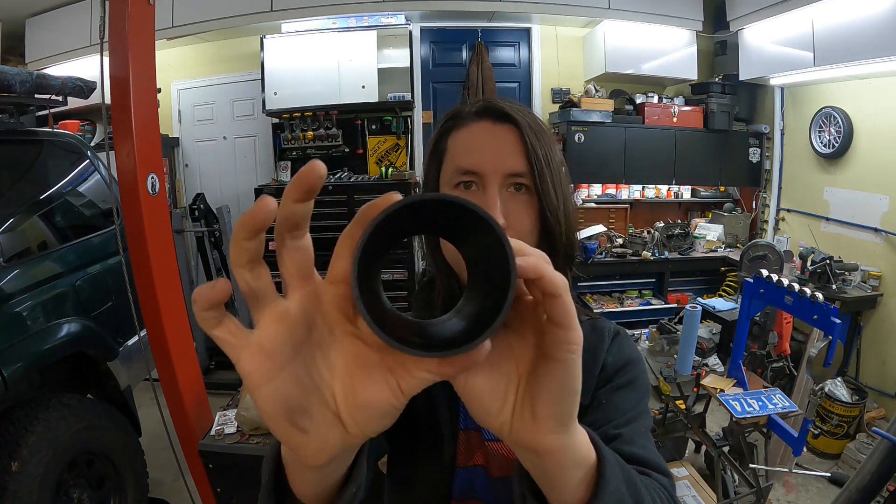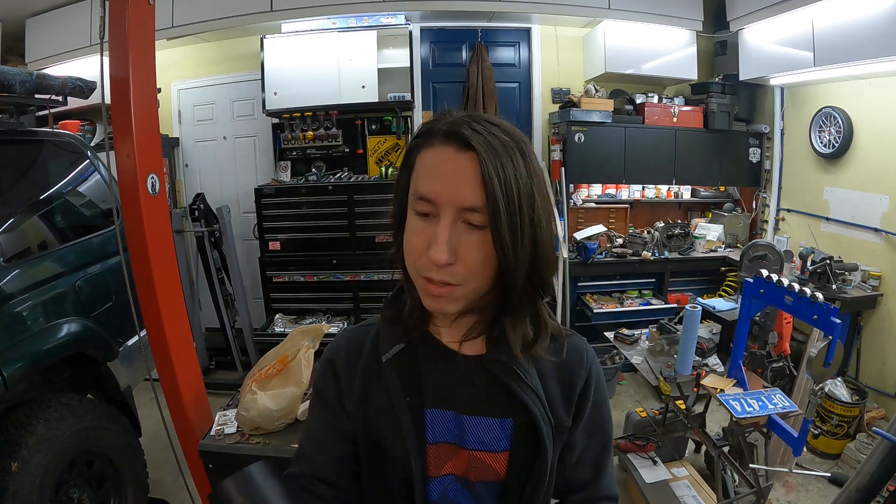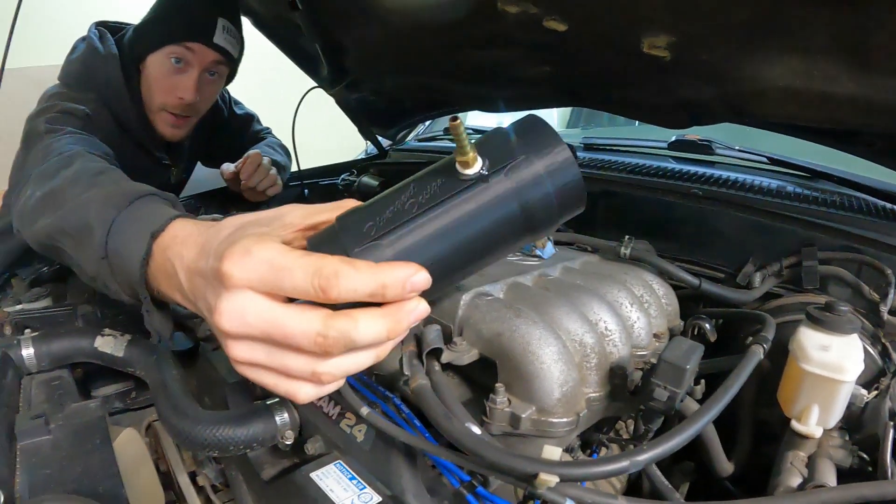So we're swapping it out with this new one — it's proper round. It's actually printed a little bit thinner than the PETG unit, but this one's been printed out of ASA. ASA has a much higher temperature rating, so it shouldn't have any problem in the engine bay. The problem with printing in ASA originally was very difficult because I didn't have an enclosed printer — every time I tried it would warp. But now with an enclosure and an upgraded power supply, I was able to get the bed temp up to 100 degrees as needed, and we got a successful print. I've already tapped this, I'm gonna swap over the brass fitting, get it installed, and we'll do another test in a year.